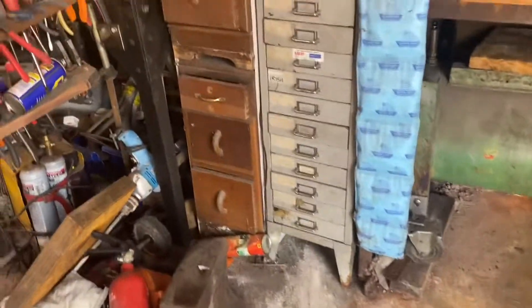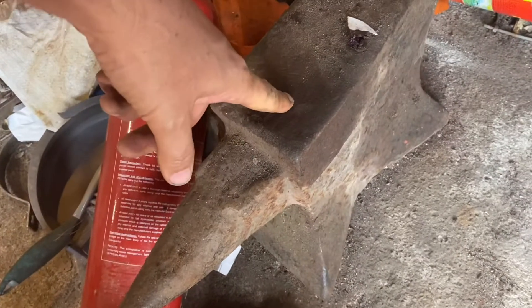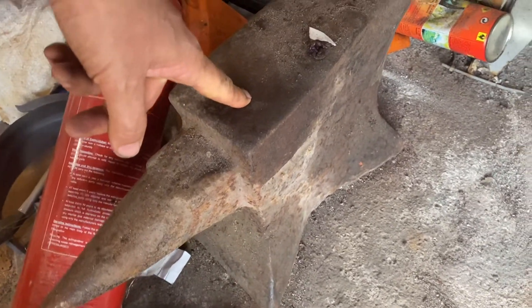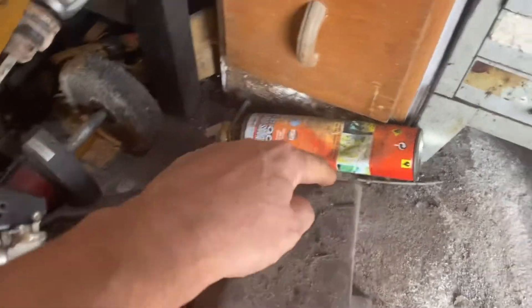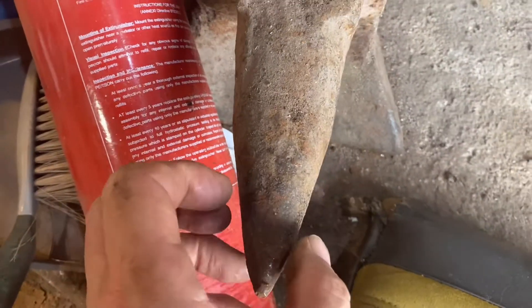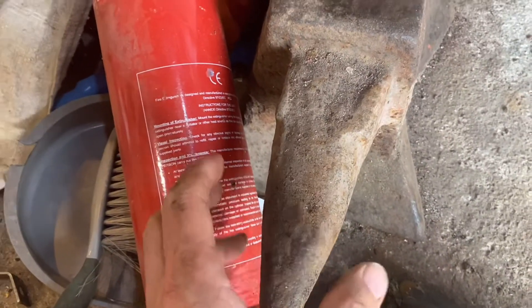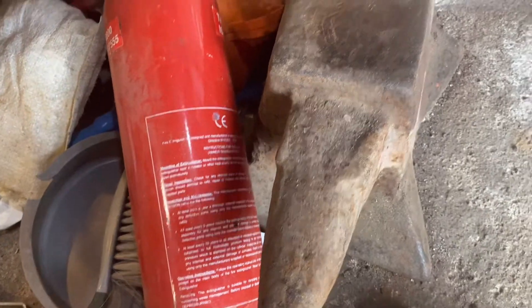I was going to give you a tour of this corner that we haven't been to in ages, because that drill sits in front and everything clacks in around it. First of all, if you get a chance, pick up an anvil. The things are getting very pricey and they're very heavy to move — this one's got a back chopped off it — but they're still very handy if you're warming up metal, hitting things, saves damaging your bench. Just the other day we wanted to swell up the end of something, so we just smacked it on there and it opened it up enough.